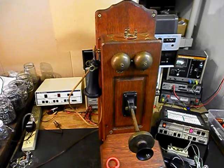We also had to adjust the bells. We went ahead and went through the solenoids. We made sure that they were working properly and all the solder connections were good. We went through the hook switch. That was taken care of. We also repaired the radio on this unit.